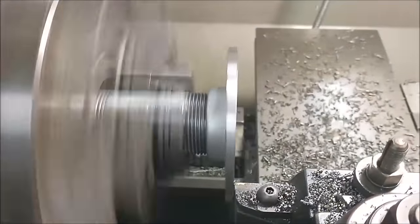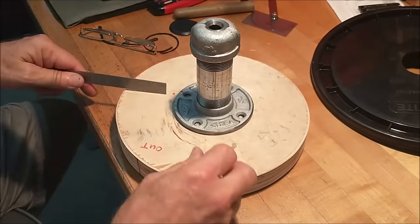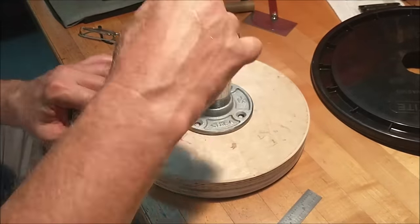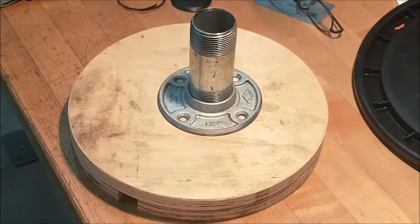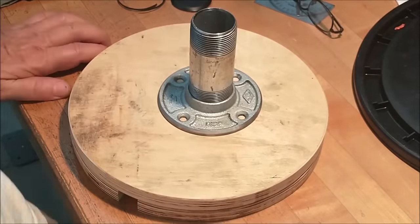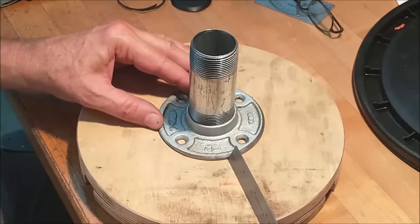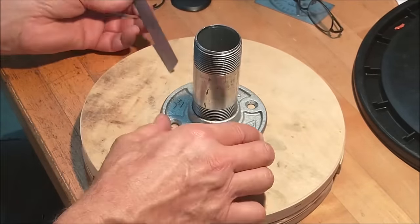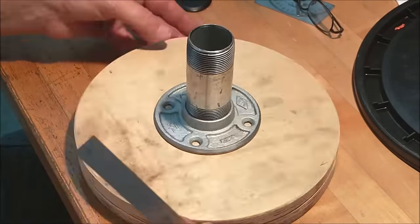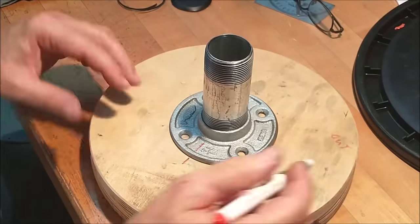This operation is turning the flanges square to the pipe — perpendicular to the pipe and round so I can center them up. I'm not going to go by the holes; I'm going to go by the outside because I know the outside is true to the pipe. One end has a cap, one end doesn't. After we get it all centered up with the scale, we'll mark out the holes, take it over to the mill, and pop the holes in short order.